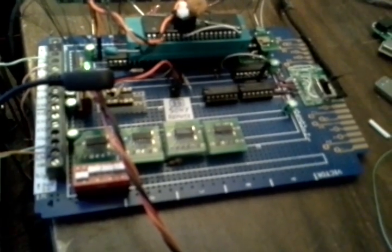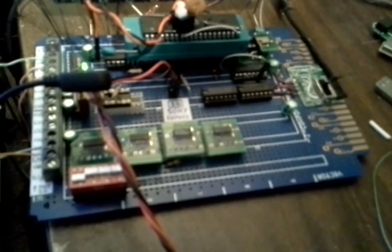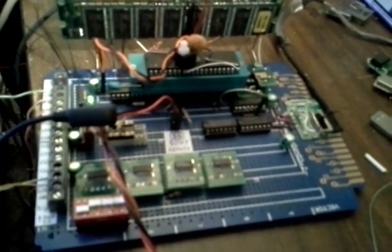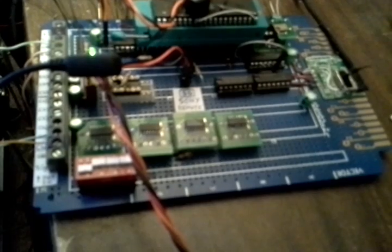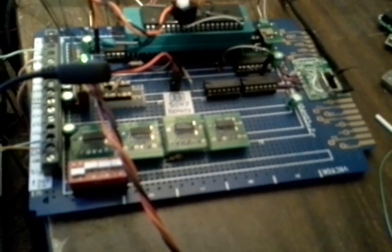So like an instruction, like the write instruction for instance, would be 2 SDRAM clocks wide, but using this circuitry down here it makes it 1 SDRAM clock wide. So it's pretty simple stuff. It's just a flip-flop and a gate for each signal that needs one, and there's 4 signals that need them.